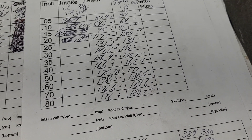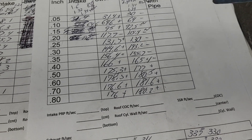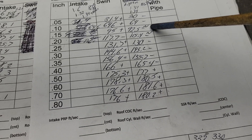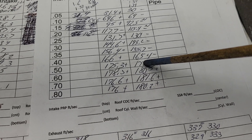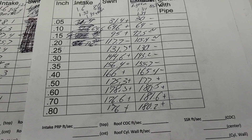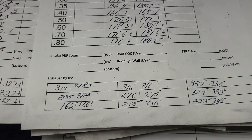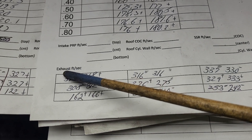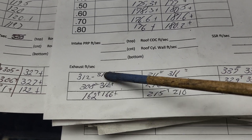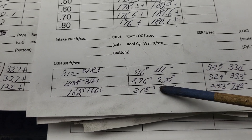I know which one I like better — I would take this one all the time. Not happy; the noise tells us it's not happy. And when we take a look at the airspeeds, we'll be able to figure out a lot of what was causing the issue. Nice crowded paperwork for you guys. So we're comparing these numbers to these numbers — plus, plus, plus, that looks good. Over here, equals, minus, minus — not as good.